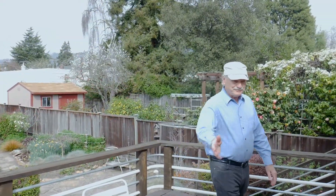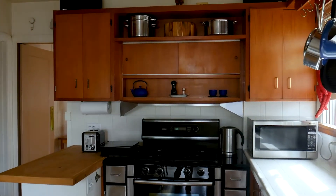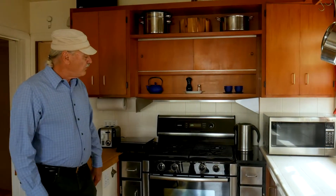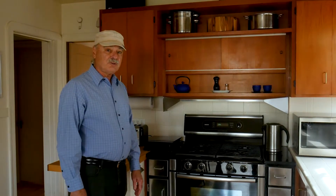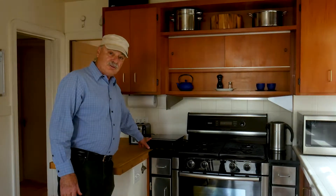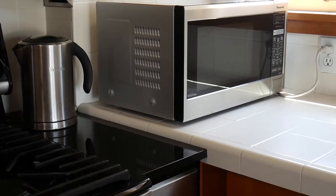Okay, let's take a look in the kitchen. This is the one point where we haven't fully converted to electricity. We still have a gas stove, but we are ready for an induction stove because we have already installed our 40 amp electrical outlet when we did our upgrade to the 200 amp service. Right now we continue to use an induction cooktop unit here and an electric teapot as well as the microwave.